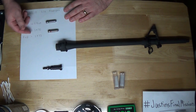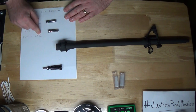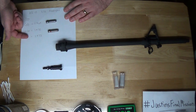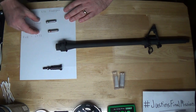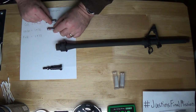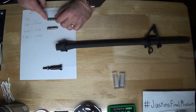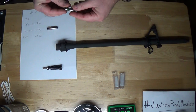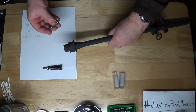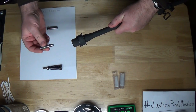The field gauge is 1.473, and SAAMI spec is 1.474. Either way it gives a little more tolerance — a little bit looser. For civilian use, especially with a brand new barrel, you want it to be as accurate as possible, and since we feed all types of ammo through ours, you want to go with the no-go. The go gauge at 1.464 — here's how to check it, especially when the barrel is off, though you can do it after it's assembled as well.